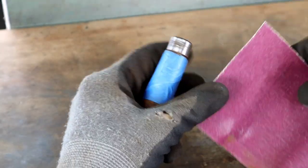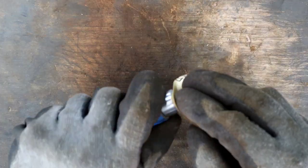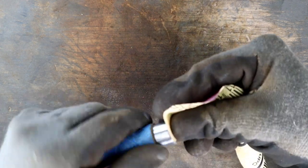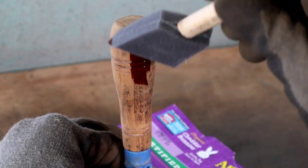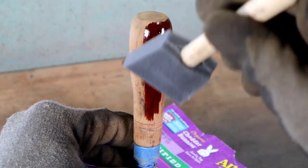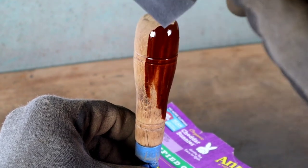Before you apply that stain, I took care of the rust on the handle. This is going to go against the grain, which is why I taped off the bottom of the handle. I used the same two grits for this because I'm not going for a polished look on the frame and I want this handle to match. The color of the stain I used was the same red chestnut from the Stanley hand plane video. I fell in love with how that handle turned out, so I'm looking to replicate that here. It's very similar to the original color that was on this, but it's going to have a subtle red hue to it.